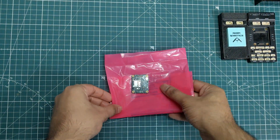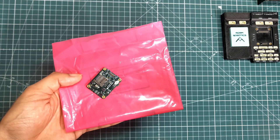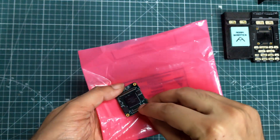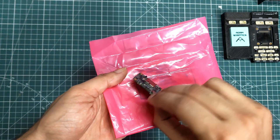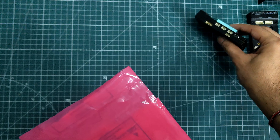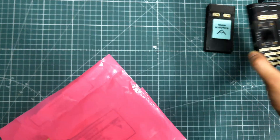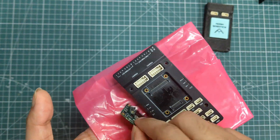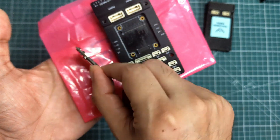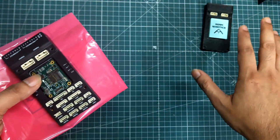The board is finally here. We can move forward much faster, do a lot of development, and work on the firmware. Before we go on, I just wanted to give a closer look after the tabs are broken. The final flight controller board is here, and you can see the assembly with our carrier board. The flight controller is backwards compatible — it has the same connector with the same dimensions, so it connects and snaps off. You can use just the flight controller on your old carrier boards, or go with the complete package.